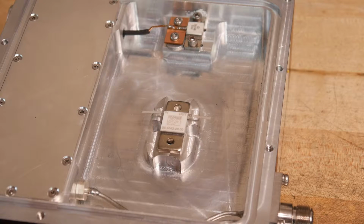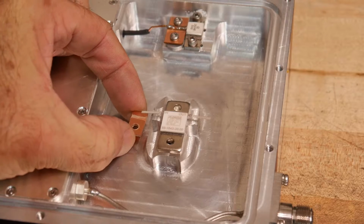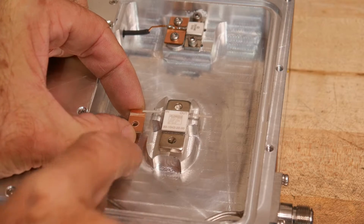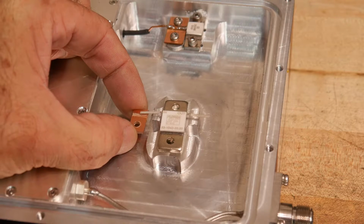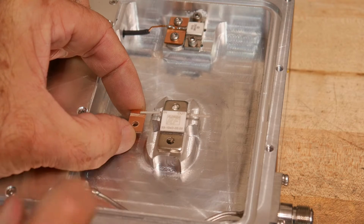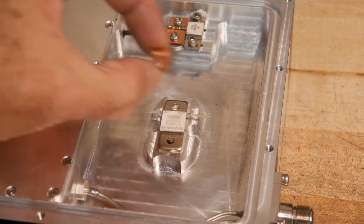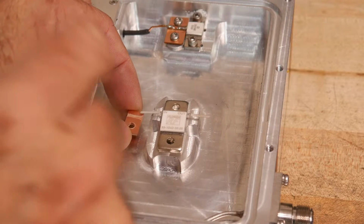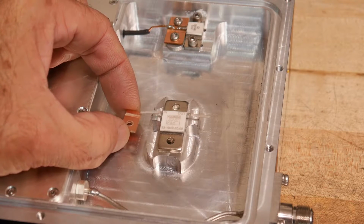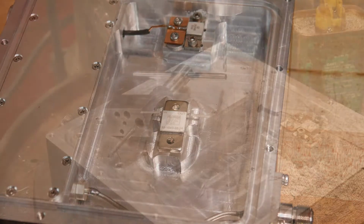We'll have our little PC boards mount out here. I'll build little standoffs for those of the right height. I'll just measure this pedestal, and actually I need to cut a little higher than the pedestal because this is thinner. I'll make a little standoff here, make two identical ones for the other side, and drill and tap those, and that'll give us a great mounting.